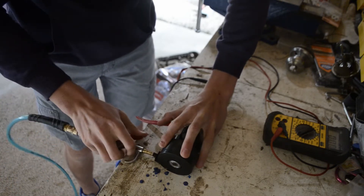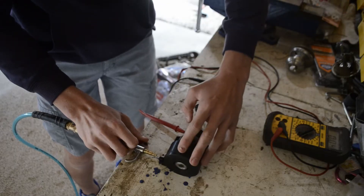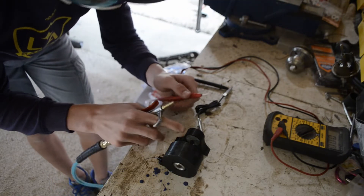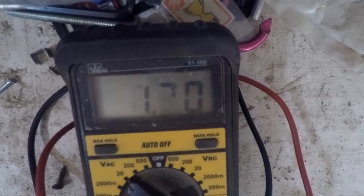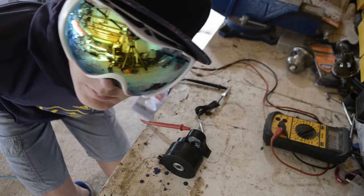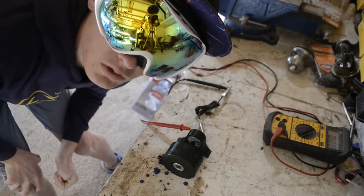So the turbine — it looks like the coupler between the motor and the turbine are not quite fully balanced, so if I put any pressure down it will not rev up. We're at just about 1 volt right now. So 1 volt at 50 psi is not optimal. I'm gonna go pump up the compressor. Alright, so that's 75 psi — let's see if this turbine will produce any more than just 1 volt.